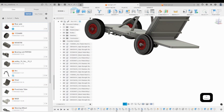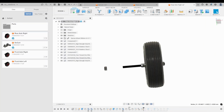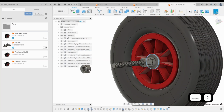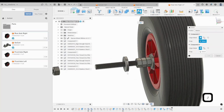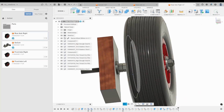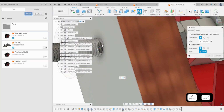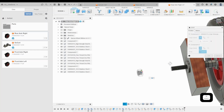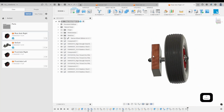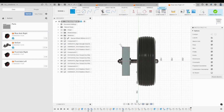Now we can move on to the final part of this video, attaching the right rear wheel. The design of the right rear wheel is very similar to the front wheels, with just a different method of wheel holder. To make it easier, I copied the front wheel design and removed the parts that weren't needed. What remained was the 26 mm wide wheel, an M12 lock nut, two wide washers and standard M12 nuts to create spacing and prevent the wheel from rubbing against the baseboard. As shown in the 3D model, at the end I needed 3 nuts for spacing. 2 wouldn't have been enough. Of course, inside the wheel there is also a mounting sleeve, just like in the front wheels.